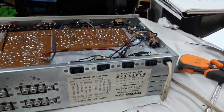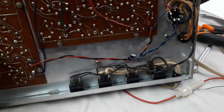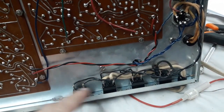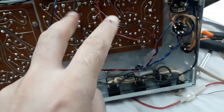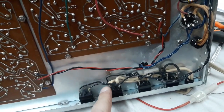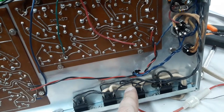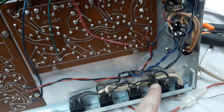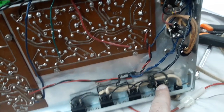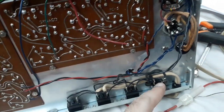Right, okay, look in here. This uses an ungrounded power cord and non-polarized plugs here. But the way it's wired, the left hand lugs here are the hot voltage junctions, and you can see here on this left one, it's this left one that goes to the power switch and comes back live to continue to these switch outlets. Okay, these are like if you wanted to power your power amps, when you switch this on, all 3 units, this and the 2 power amps would switch on, or you know, 1 stereo.